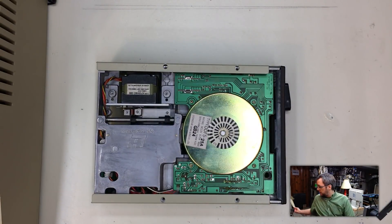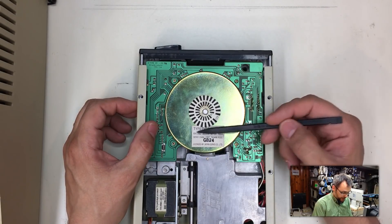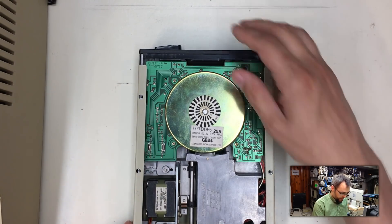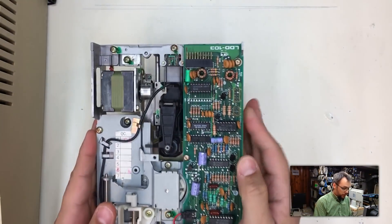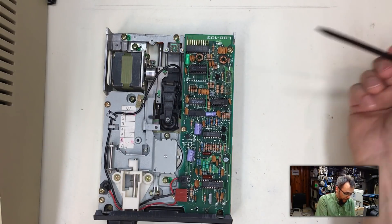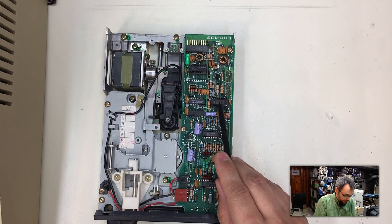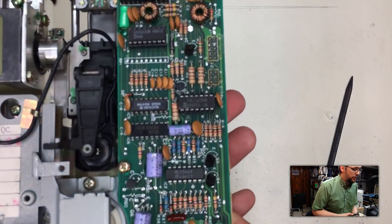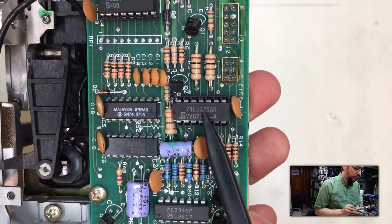The back panel comes off and you can see the underside. This is a pretty typical generic drive unit — it has the synchronization pattern on there so if you have your strobe you can make sure it's at the right speed. Now flip this over. Look at that for a couple seconds and tell me if you can see what is wrong. This chip right here does not look right — there is some dark discoloration right around the center of the chip. Zooming in, you can kind of see it's a little darker there in the center. That chip has seen better days.